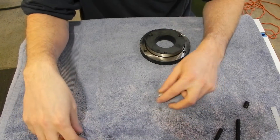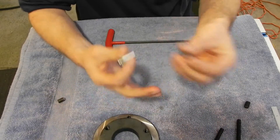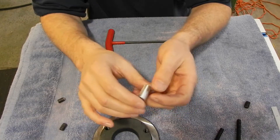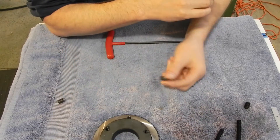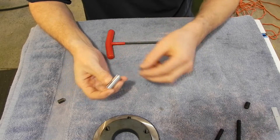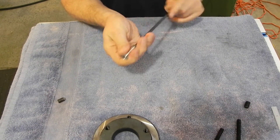What I need to do is make a DIY collet to hold the set screws for machining. If I had the right size collet I could just put the set screws in the collet directly, but obviously I don't. So what I did is make a little DIY handful-of-use collet: it's just a piece of aluminum stock that I drilled and tapped for these set screws, then took over to the band saw and slit it. To use this, the front-slit part is the front of the collet — you screw it in all the way to the front so it's sticking out, then mount it in the chuck. I'll go over to the lathe and show you what we do from there.